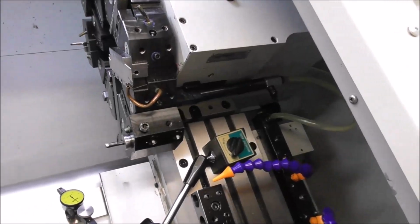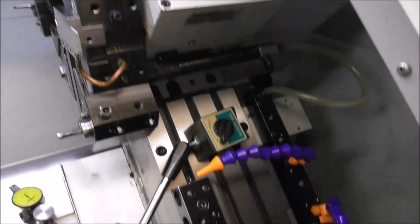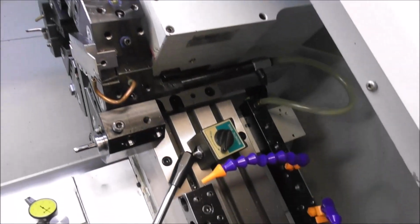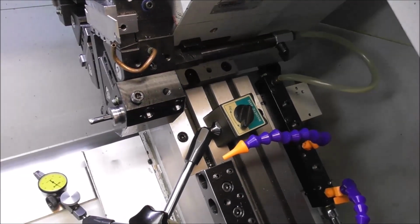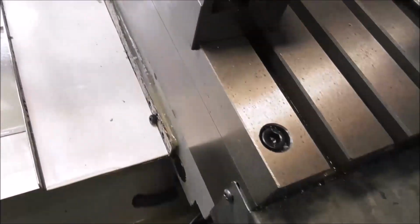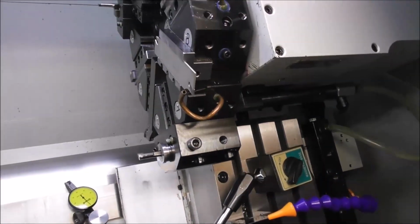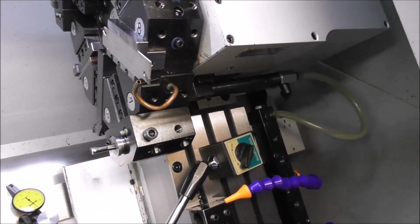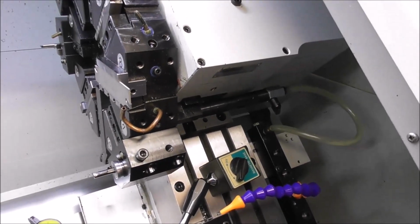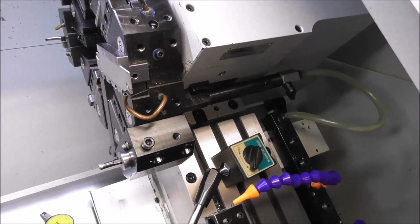So you know that draw racking effect that I was talking about, well, it is reduced somewhat because of the sheer weight of the load on that narrow slideway down there, because the turret and everything adds up to hundreds of kilos of weight. It's less likely to rack and jam. It's probably effectively clearance at that point, but a very good high pressure point on that top slideway, which is stopping it from racking and jamming. So that's actually a positive. One of the negative factors is actually also a positive.